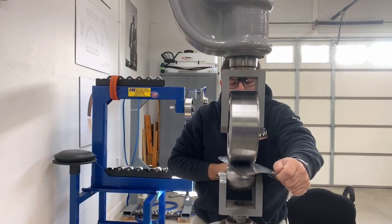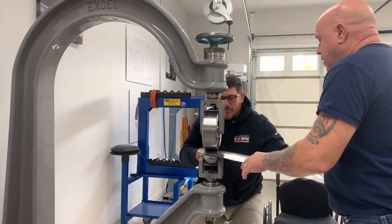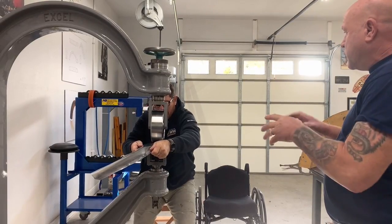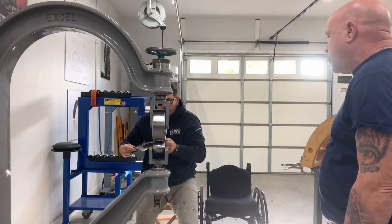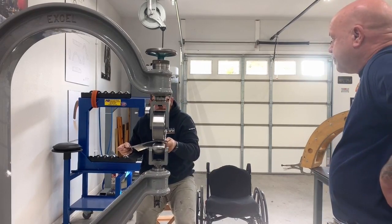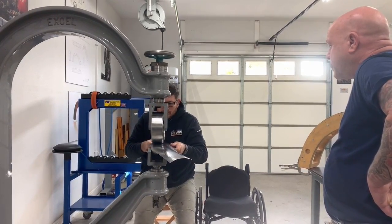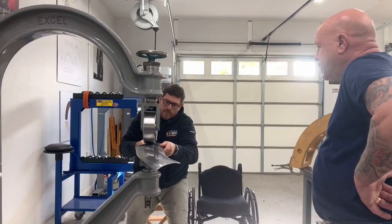So as you come to the edge of the panel, you can spin this panel around and then you can start wheeling from the other direction, just in detail. So having both ends being usable, you're approaching it from either direction, which will help you with your flow. But not in the middle of the panel? No, not in the middle of the panel. And it's just practice. Practice makes perfect. Doing a straight panel, relatively get good practice going, but it's always the curved panels that are challenging.